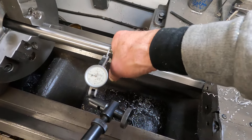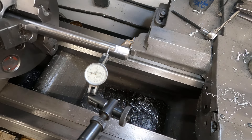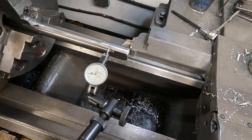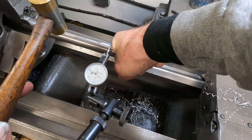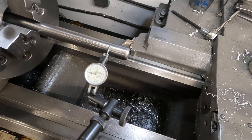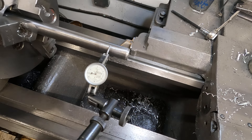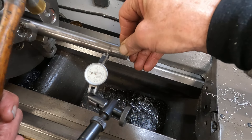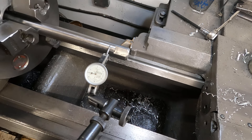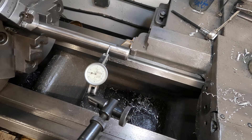That's a high spot. Counter-clockwise — not so much pressure, a little lighter tap. I got it — just slightly over a half-thousandths. I'm going to try it again. Well within one half-thousandths. That's over six inches out.